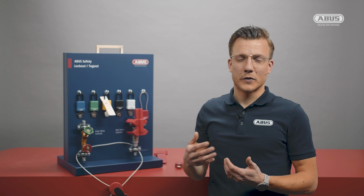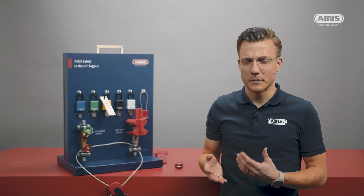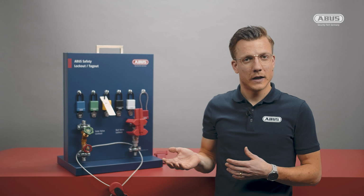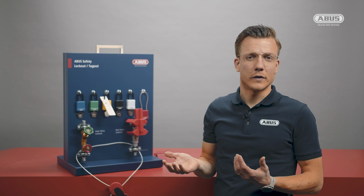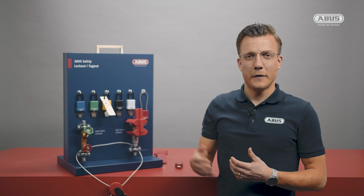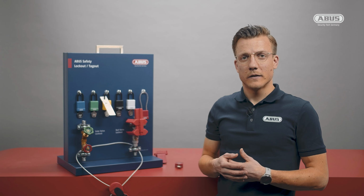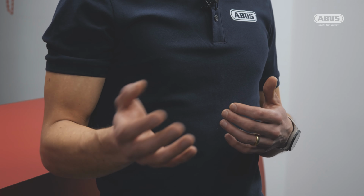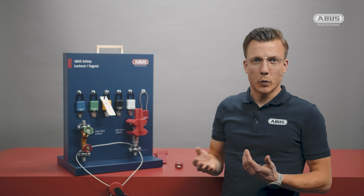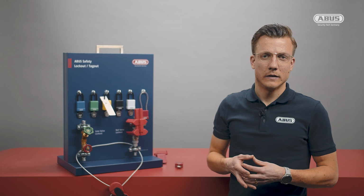A lot of those potential dangers typically go through certain pipes and can be locked out or turned down by ball valves, for example. To make sure that the flow of energy is stopped during the maintenance work, you turn off the ball valve and use one of those very well-known devices to lock out the ball valve.